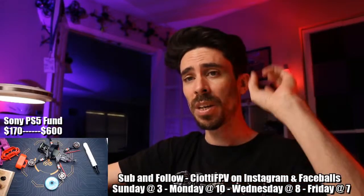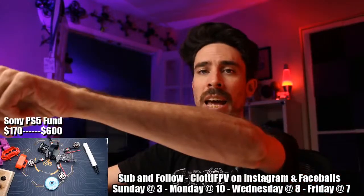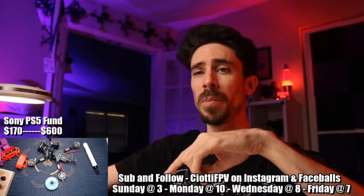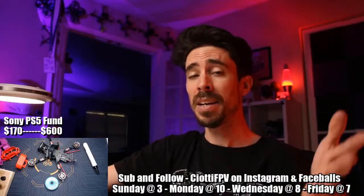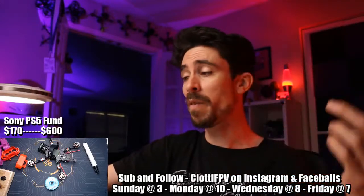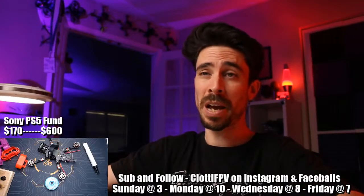The Micro Apex, I actually don't like it unless you're carrying a heavy payload, because the arms are too thick. They're 4mm thick arms. And in a freestyle setting, 4mm thick arms on a micro are never going to break. What that's going to do is put all the load into the motors. And on micros, the motors are very fragile. We need 3mm motor shafts. We get 2mm motor shafts.